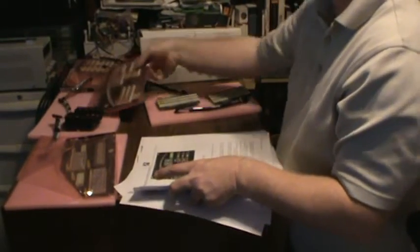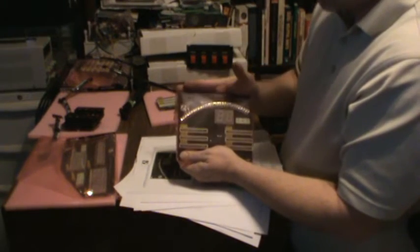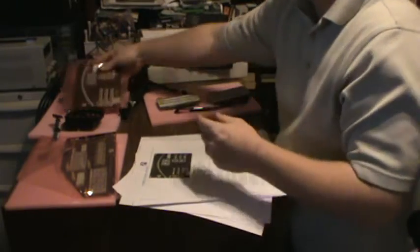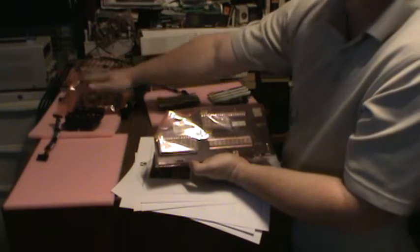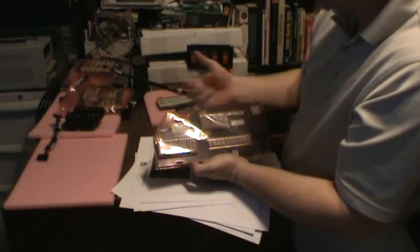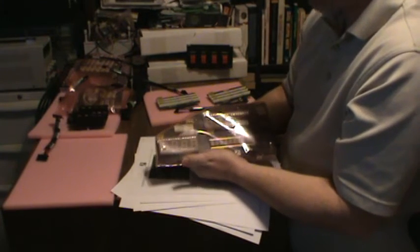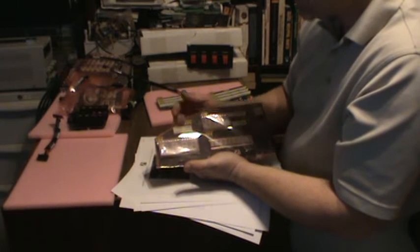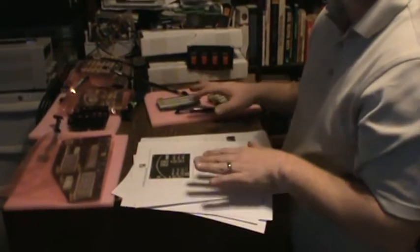The main board is the RPM board. This board seems to be the center for pulling in all the data from the car. This board also has its own processor. This is the miles per hour board. It has its own processor, but it connects to the RPM board via a cable through the voice box, actually. He's using the new CAN bus system that new cars have, which is pretty cool. So that's how the boards are communicating to each other, via the CAN bus. It allows everything to be integrated and programmed. It's pretty sick.